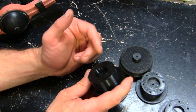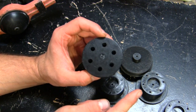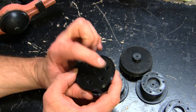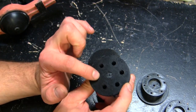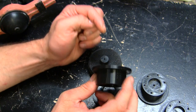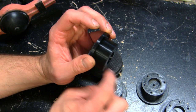You have some nice accuracy with the way the fasteners are mounted on, and it does a really good job at keeping everything at bay. If anyone's ever watched that video, you'll see a similarity here with the way these are designed. On the back portion here, which butts up against these units, I have these extra holes that are bored in, which are not going to be visible once mounted. These are where I can add the M3 cap screws, which will mount on the inside portion over here, and then their threads will emerge.